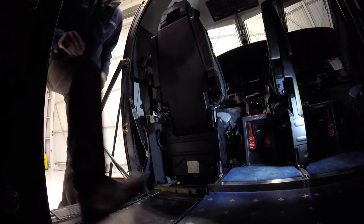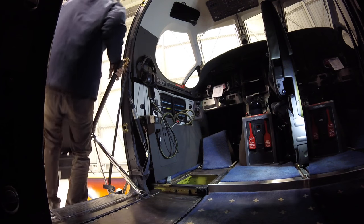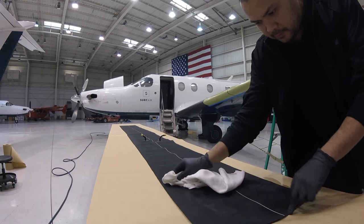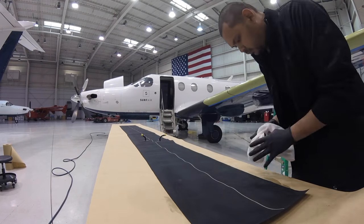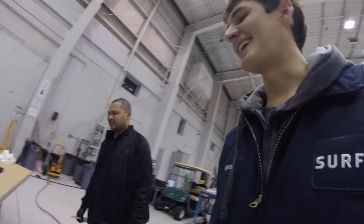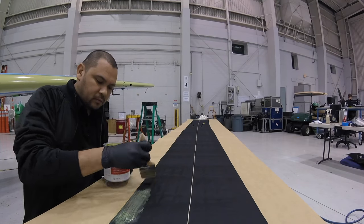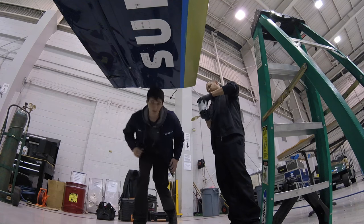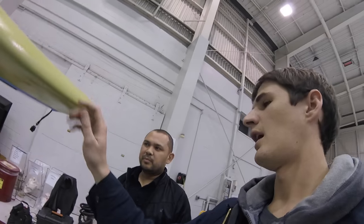Get back to removing the seat. David just finished applying the first coat of 1300L. We're going to wait one hour, let it dry, then apply the second coat — two more hours. And then we use toluene to reactivate it, make it sticky again, and then we install the boot.